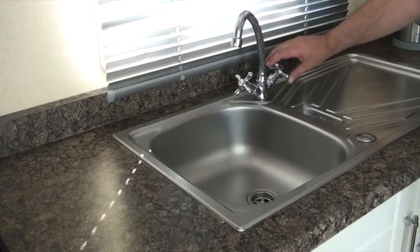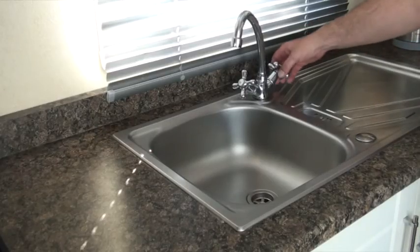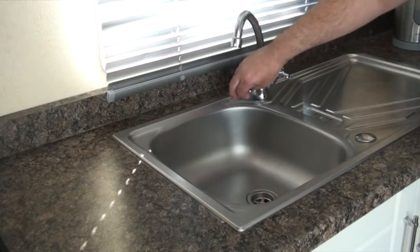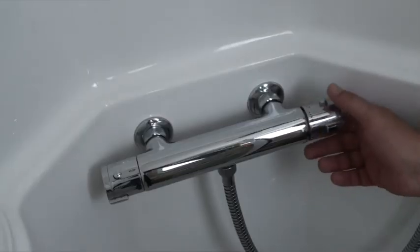This brings me on to another important point: how to leave your water system over the winter months. We've been turning taps on and off throughout the drain down process, and at this point all of those taps will be in the off position. If you're leaving the property over a cold spell, it's important that you turn all of those taps back on again before you leave, so that the pipes can breathe. Incidentally, oxygen in the air circulating through the pipes is also a great steriliser. For the shower, you just turn it on fully and move the temperature mixer to the middle, and that will open both the hot and the cold pipes. If you have any mixer taps or faucets in the property, just simply lift the lever, open and centre it, which again will open the hot and cold pipes.